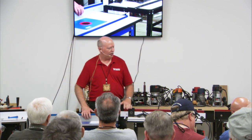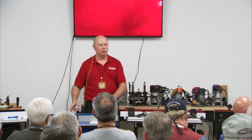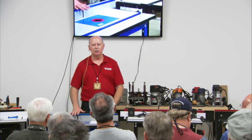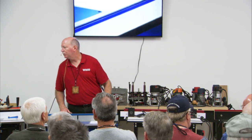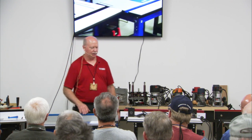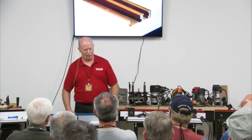One of the most important things in a router table top is making sure you get at least a miter track, so you have a miter slot. It's important for putting in joinery jigs that need to register from it, or for featherboards to hold stock against the fence. Ideally, get combo track, which has a miter slot and T-track combined — most tables have that now, and it's pretty standard. You can also buy this track in aluminum and just rout a channel and drop it in if you're making your own top. I rarely use a miter gauge on a router table, but it's good to have when you do.